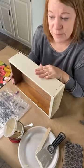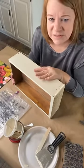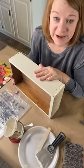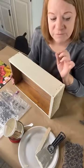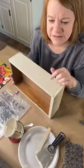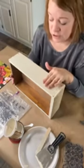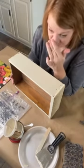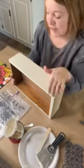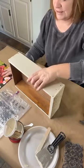You have to have a piece with drawers that are pretty loose. If they're not loose you can sand and sand until it works. It also depends on the drawer glide mechanism — if the glide is on the bottom you don't have to worry, but if it's on the sides you normally can't do that. With older furniture, take it out and look at it — make sure you have space so it won't rub off your transfer just by opening and closing the drawer. You can do this to just any piece, not only a beautiful Victorian vanity.